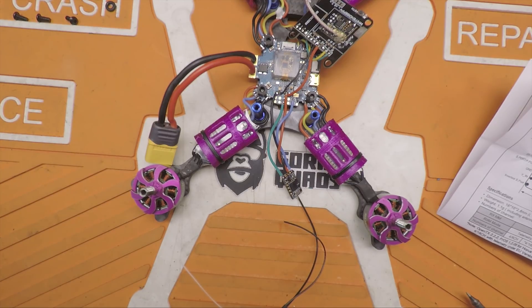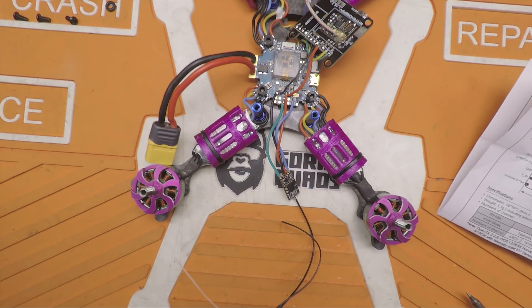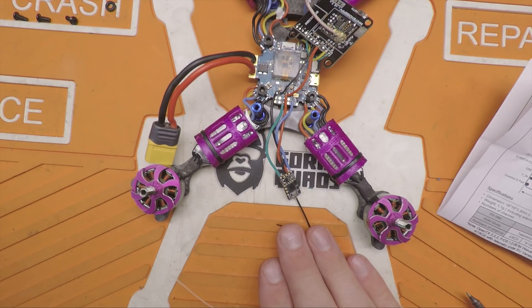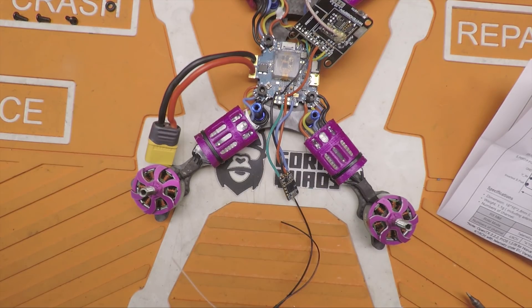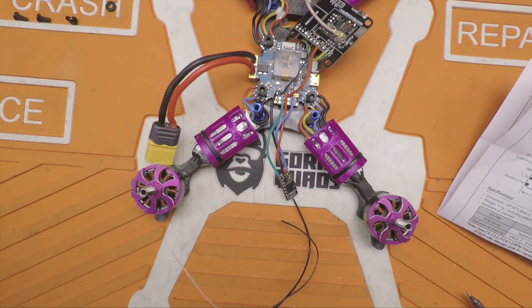If you run an F3, F7, or an F4 that does have the bidirectional inverter on the telemetry pad, don't worry about it — get an MM or a Mini, it'll work just the same. There are little differences in receivers and you just have to pick which one suits your build. If you like what I'm doing, like, subscribe, and click the bell button. Leave any questions in the comments below — I try to help out as many people as I can. It's honestly not that difficult; just follow the steps in a methodical process. Hope you enjoyed it and learned something!